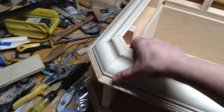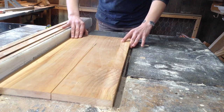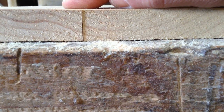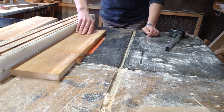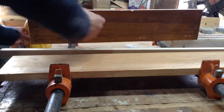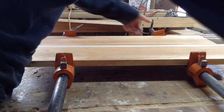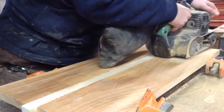Now I'm going to be putting the top on. The top is going to be a raised panel using the same three-quarter inch plywood I used for the whole piece. If you're cutting cupped lumber, it leaves a little bit of a gap because you're cutting at an angle when it's cupped. So I cut it in half to remove the cup and then trimmed off the edges on the table saw so they became more square. This wasn't wide enough for the top, so I'm adding a piece of poplar in between the two — it gives a nice little stylized top with the difference in lumber finish between poplar and pine. I always have poplar around the shop because I make all my face frames and cabinet doors out of it. I clamped this in place and let it set up overnight. Because I didn't plane or joint the boards before gluing them up, they were a little off, so I used the belt sander to level them out the next day.